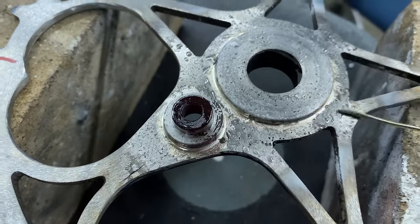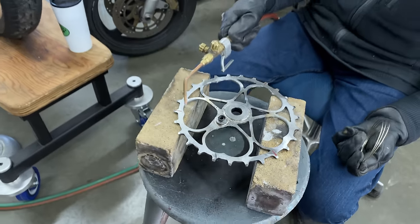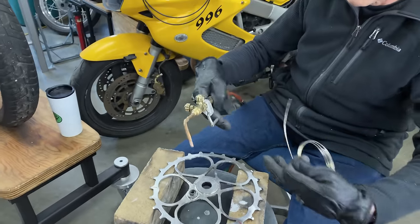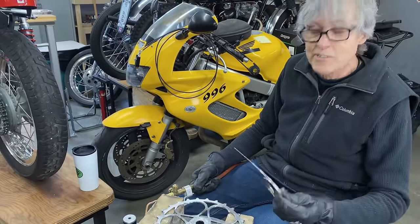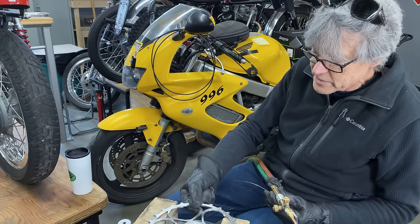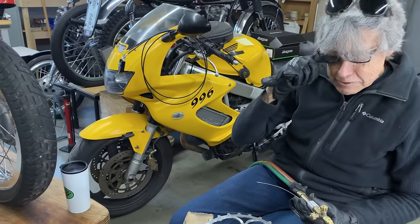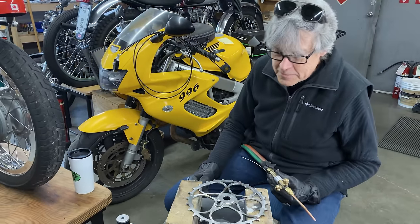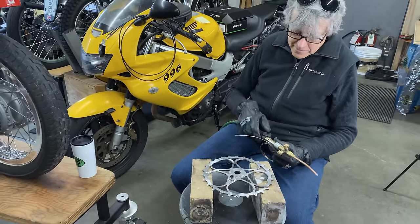It looks like it bulged up in the middle. I'm heating the middle. It's gotta go somewhere. It can't force all the outside up, so it looks like it bulged up. So I might have to make it straight after it's on the shaft. I'll put it in the lathe. I'll take a crescent wrench and hold it here and just give it a little movement. Make sure it runs true. Those are all the little details. So we'll let that cool down now.